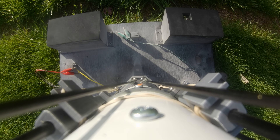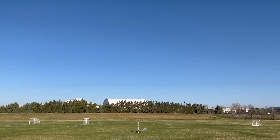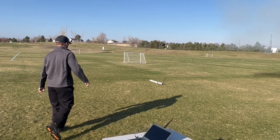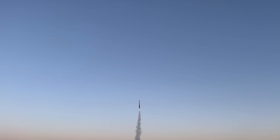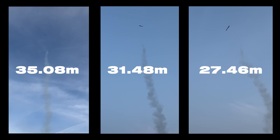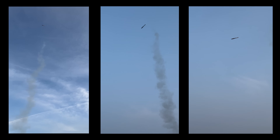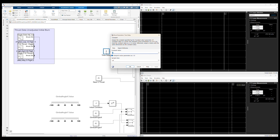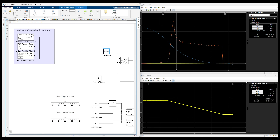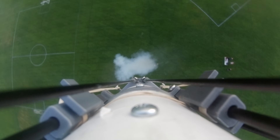With all that squared away and the landing burn altitude programmed into the flight computer, we were ready to launch Eagle. While the rocket was great at maintaining a vertical position during landing and the secondary burn was successful in the first couple of flights, the timing was horribly off. As we kept flying, more problems started manifesting but they all simplify down to a handful of issues. Three attempts with the same motor and control gains achieved different apogees, meaning a static burn altitude wouldn't work — we needed something dynamic. To address this I started dropping the rocket at different altitudes in the simulation and having it land, then plotted those burn altitudes against apogee and found a perfect linear relationship. As a result, when the rocket reaches apogee it calculates its own burn altitude.